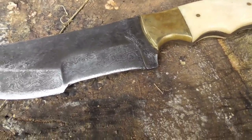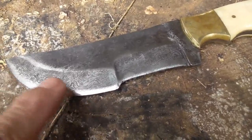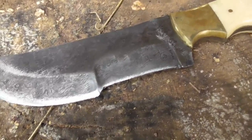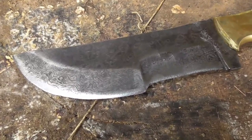I need to get a strop on it. I put it on the buffer for a couple seconds. I use the right-angle grinder to get a burr on one side, then I flip it over and take the burr off, putting it on the other side. Then really light back and forth two or three more times until you can barely feel any wire burr on it. Then I take it on the buffer for about a minute at the most — three or four passes on each side.